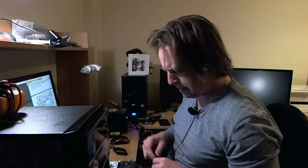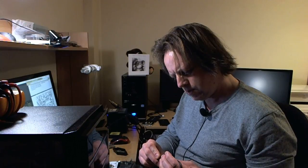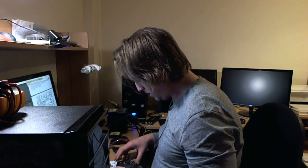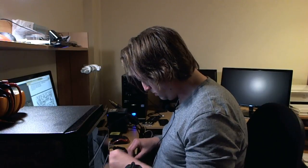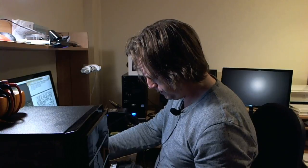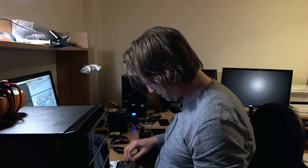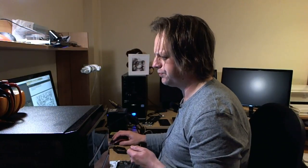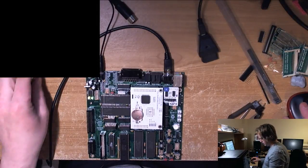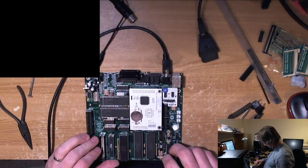I had this exact issue on an LCD, says Stephen. When trying on a CRT, it was a rolling screen. I think from not having the oscillator jumpered. Could be something along those lines. I remember the machine I was trying to fix a while ago and it wouldn't work because I'd forgotten to solder the legs of the socket. Yeah. Just for the hell of it, I'm gonna swap this jumper from NTSC to PAL. No good reason. It didn't do anything. Nor should it.